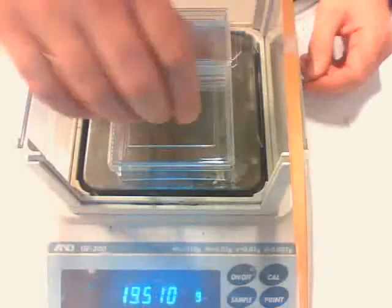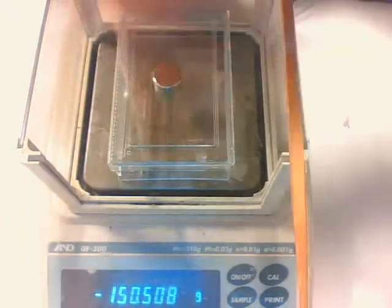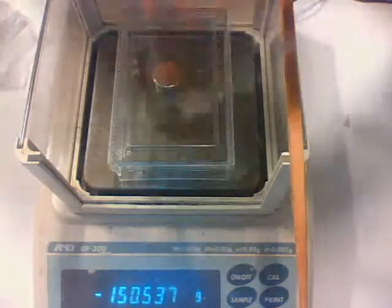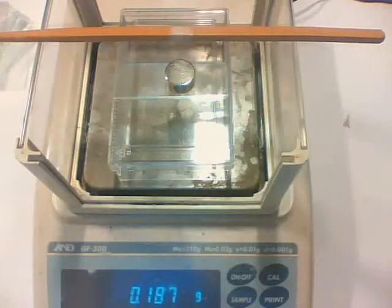To have a defined distance, I remove 30 microscope slides. Each slide has a thickness of 1 mm, so in this way I can have a distance of 30 mm between the neodymium magnet and my sample. I now place it on the balance and re-zero. This sample is not a virgin magnet so it already has some magnetization, and you can see that even at a distance of 30 mm we see quite a strong signal.